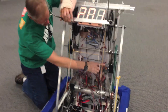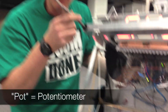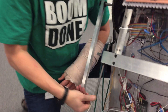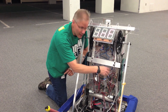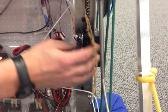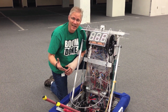We put a sensor right here on the arm that gives us the velocity of the arm. We already had a sensor — a pot — that tells us the true position, but we wanted to do feedback control on the velocity so we're always releasing not just at the same angle but at the same speed. We used the WPI libraries which have a PID for velocity — they call it K-rate. We're measuring velocity from encoder pulses — the same encoders we use on the wheels — through a simple one-to-one laser-cut ABS gearbox. Now those pulses tell the cRIO the speed, and we set the parameters to release at a certain velocity.